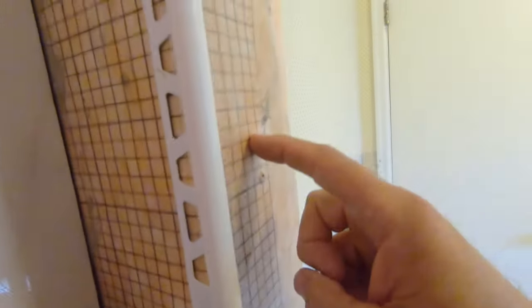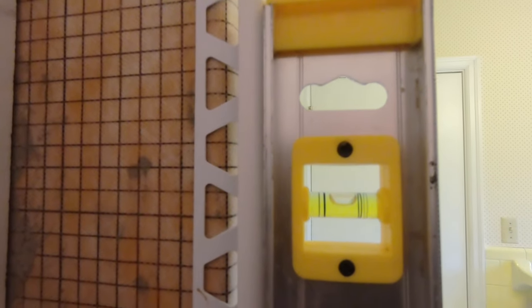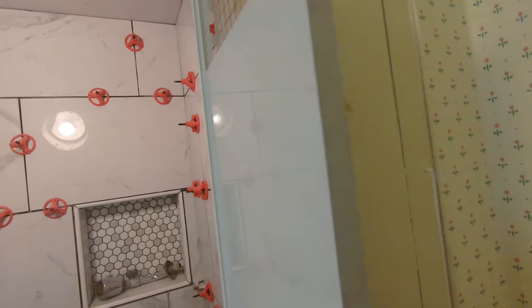You can see here we've already attached these, and this is the last side that we're getting ready to tile. We want to make sure that this is a completely vertical surface, completely plumbed. Both of these walls here are not, so what we've done is attached this Schluter edge with just a simple screw — screwed them through the plastic itself — so that this is completely vertical. When we put a level on that, we got a nice level surface. Now when we add the tile to this side and this side, it's going to be completely vertical. Once we put our tile on the face here, there'll be grout behind it, and it'll end up looking very clean on the inside as opposed to having a rough, nasty edge on the end.